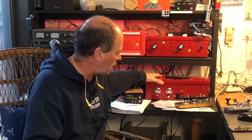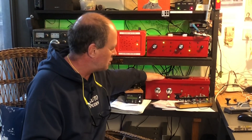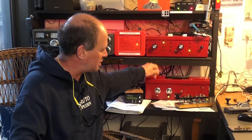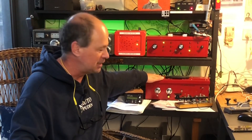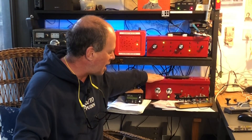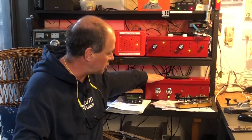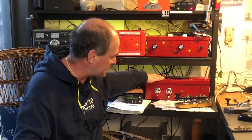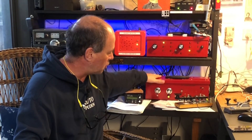I'd really like to have this case sitting on my bench and be using it. The plan is to take that VFO I'm going to be building and put it into this device, so I can rescue the air variable capacitors in here — they'll be great for other projects. The plan also is to take the Prog Rock and use that for the transmit section, so I'll have channelized transmit with a digital VFO happening on this side.